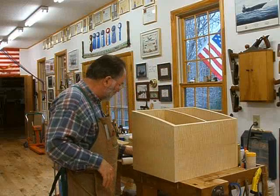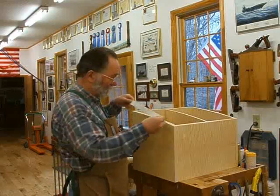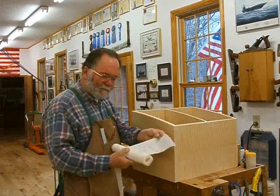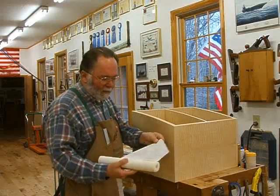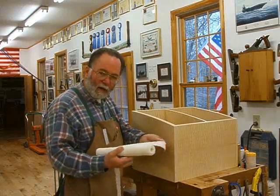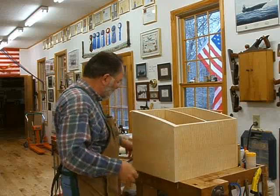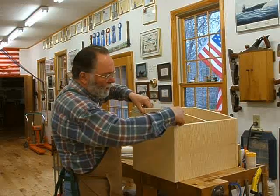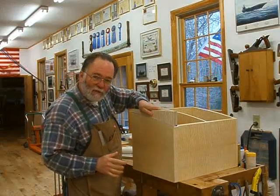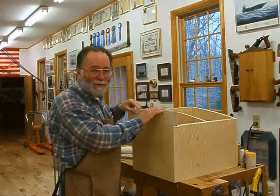So I had an idea, and you are witnessing an experiment that worked — because you're seeing this. If it hadn't worked, I wouldn't be showing you. I bought some of this shelf liner material; I think it has the word 'grip' in the title. It's a rubbery stuff that has a little bit of tack to it, and people use it to line the inside of drawers. I'm going to lay a little strip along here and then put my caul on here. And look — it doesn't slide. So I ought to be able to clamp this and not have the caul slide off the curved end.